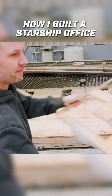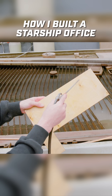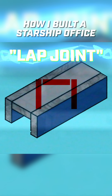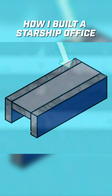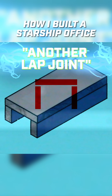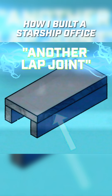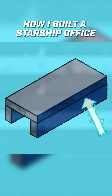Now that we have our pieces cut on the water jet, I need to decide how I want to go about building our floating middle columns. When it comes to building a three-sided box, I have three methods that come to mind. The first being a lap joint — easy and simple to build. It's one middle piece sandwiched in between two side pieces. However, the downside is you still see exposed end grain of plywood. The second method is another version of a lap joint where you have two shorter sides capped with a top piece. This method still shows end grain of the plywood but shows significantly less of it. This is not ideal because we want our column to look like one solid piece.